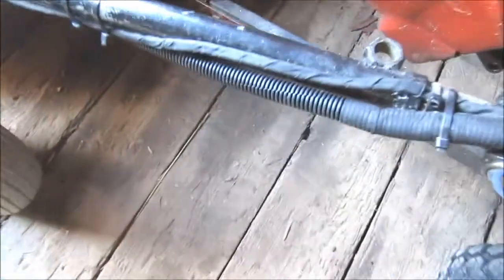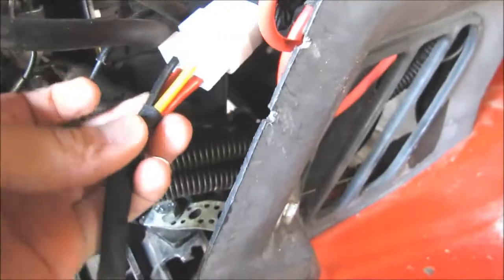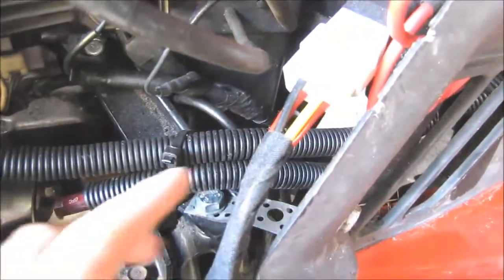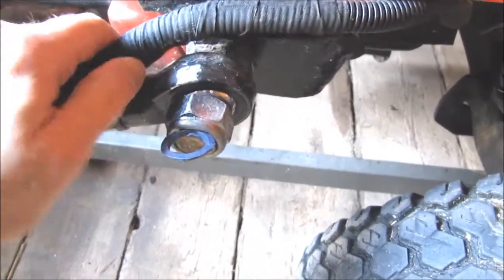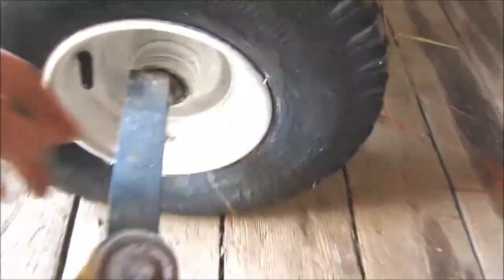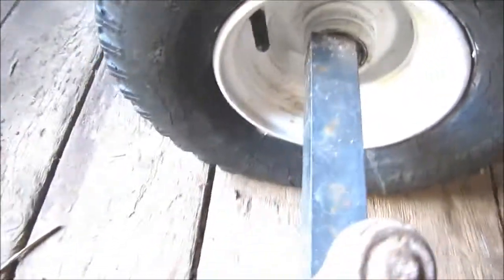The electronics of this thing have these two cables going to the tractor, and they have just plugs. There are lights and the electric winch, so four wires. So taking this off is easy, just have to undo these nuts on each side and those pins, and the steering, which just goes to the shaft of the front wheels.